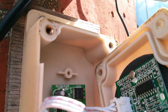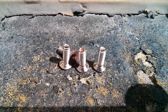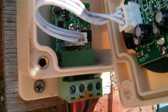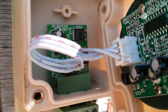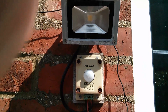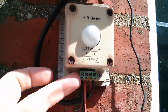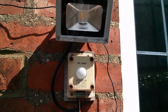And there are gaps in it, which you can see there on the back plate. And these four screws that hold the front on — despite the faces being very rusty, the threads themselves aren't rusty, so they're fine. So those connectors are really just to replace what's on here. I'll certainly replace the external part; I might even replace the internal connector. That means re-soldering a new one onto the board. But it looks like I've bought exactly the right thing. Now I'm pretty sure this all works at the moment, but every now and again the wife comes in and says the outside light's not working, and I just have to waggle this connector and make a new connection. But if I replace the connectors, that'll give it a new lease of life.